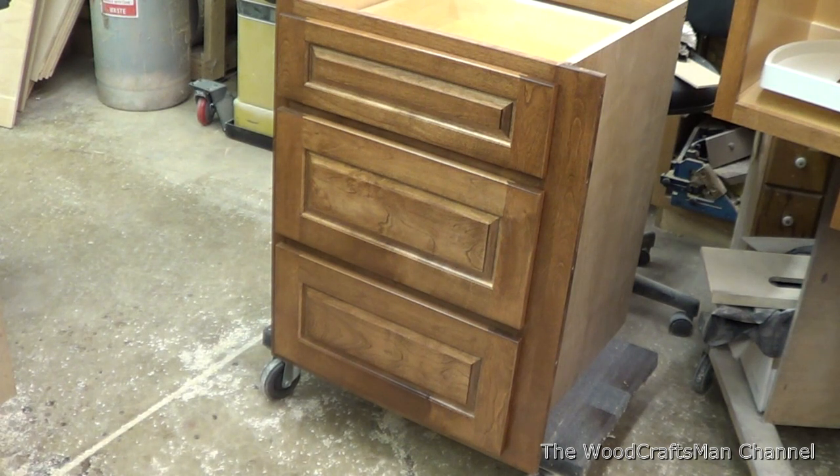Between the latching devices, which have a side-to-side adjustment, and then also the rear of the drawer guide, you can tweak it up and down. And you can also adjust the front of the drawer up and down as well. So I may need to slightly tweak that. For some reason, that one is slightly out of whack. I'm not sure why. This one here.